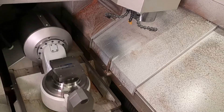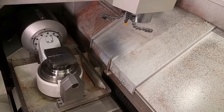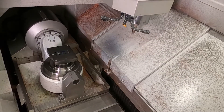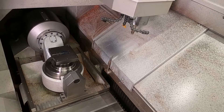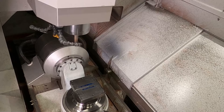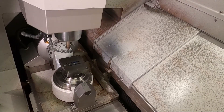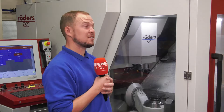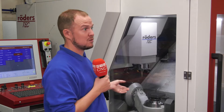Do you have a system in place to continually monitor tool wear? At the end of each process, or when a new tool is loaded, the tool automatically comes to the front of the carousel and there's a Blum lasering system. This checks the length and diameter of the tool, and we set a tolerance for how much the tool can be over or under. Our longest process has been about 36 hours, but because there is spindle cooling through temperature control and thermal compensation for cutter life and wear, it can ensure these accuracies and produce the best parts we can.